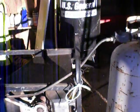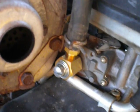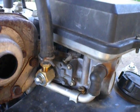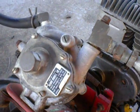A two-stroke, of course — you have to buy that all as one complete unit, but it's just about the same as any good commercial weed eater. I've had mine for about three years; started in dead cold winter, cranked right up. Eliminating all those carburetor problems would be the perfect setup. All I did was drill a hole in the side of the carburetor, cut my little spud-in part down, fit it in there, bolted it up tight — a nut on each side — and the adjustment screw was almost all the way in to get it to run smooth. Once it was all the way adjusted right, that was the only adjustment: screw it in until it runs good. That's it. Talk about simplicity.